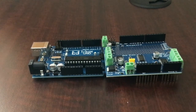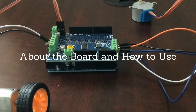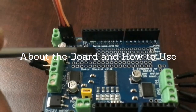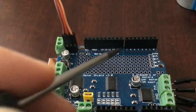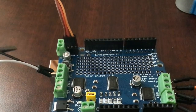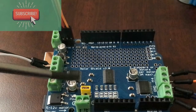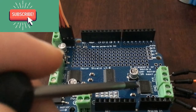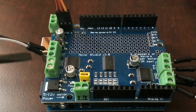All you have to do to start off is mount it — just like that. You can use external power supplies. This little area here is just a prototyping board; there's nothing really special about it. Right here are the PWM pins, and here is where you can give your servo motor an external power supply. There are basic circuit components like resistors, diodes, and capacitors, plus filter capacitors to reduce noise. Then right here are the screw block terminals.